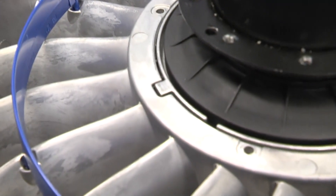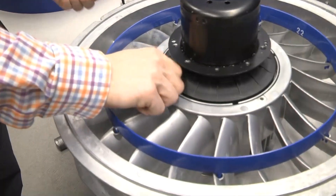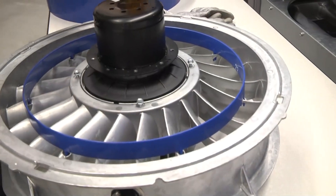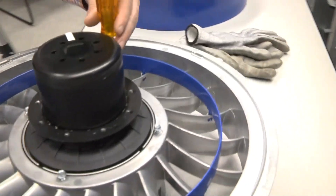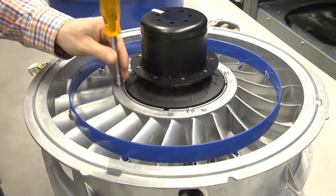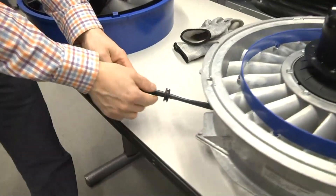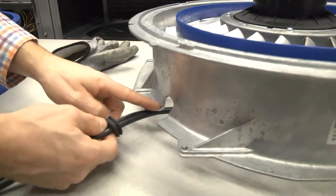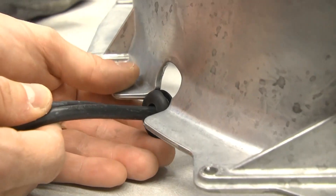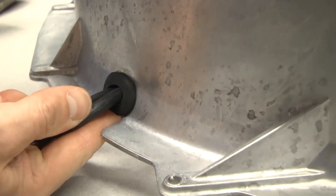With the motor on a stable surface, pick the stator up, set it on, and line up that key feature. Then take the four hex fasteners and start them into the pre-threaded holes in the motor. The final step is to fish the cord grommet back through the slot in the stator. The cord grommet has a split ring on it — just slide that on your cord until the grommet is aligned with the slot in the stator, and gently push upward and it should feed itself into the stator.